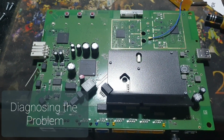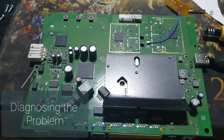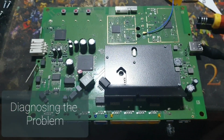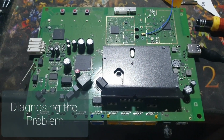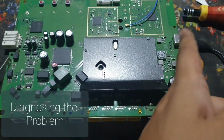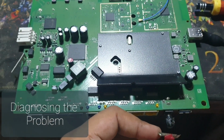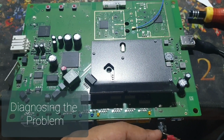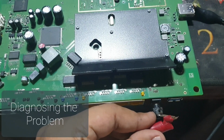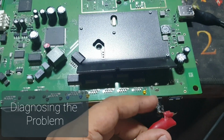So I will use the voltage injection method to diagnose the short circuit. Okay, so I have prepared the voltage injection setup here. I've connected the ground, and now I'm injecting. I have a 3.3 volt power supply here, so let me show you. When I'm touching it, there's a clear short. That's why we are having this spark here, and it also gets very hot.